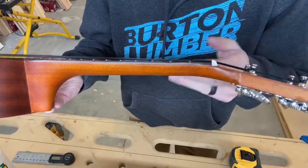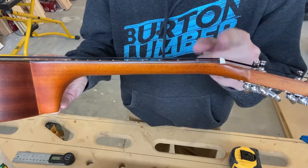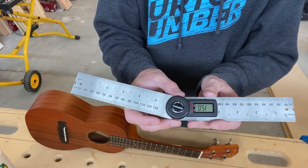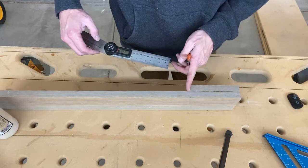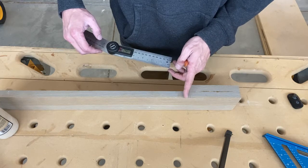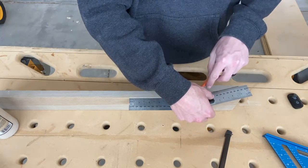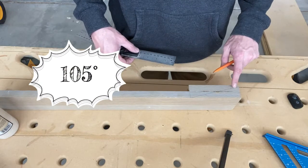What I need to do now is figure out what this angle is so I can match it on the new headstock I'm making. I'm going to cheat and use a digital angle finder — a 15-degree angle is what I'm going to make happen on this headstock. I've drawn a line to give me a reference of where this continuation happens, and having this reference line I'm now going to set my protractor right here and draw a line — that is my 15-degree tilt.